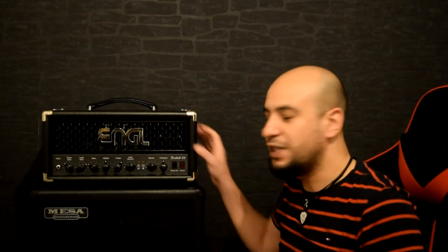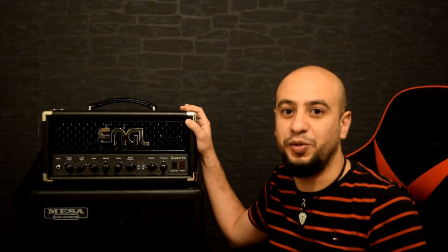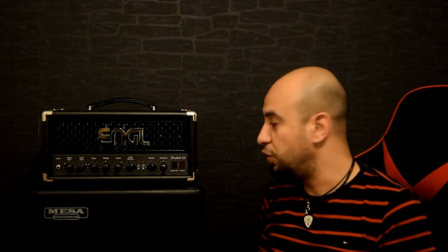But still running with 6L6 tubes. Generally in that watt category, the 25 watt, it will be working with 6V6 or the most common and popular one, the EL84. But this guy has real 6L6 power tubes. And for me personally, I love the 6L6 tubes. And it also contains four ECC83 preamp tubes. So let's look at the functions in this amp head and start with the front panel